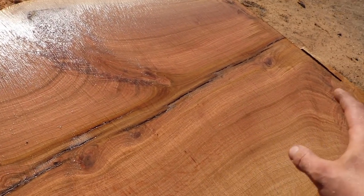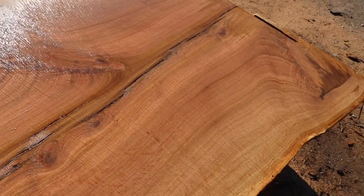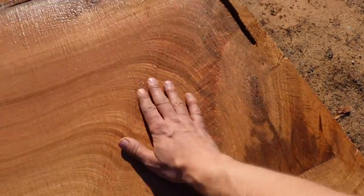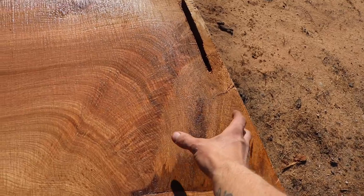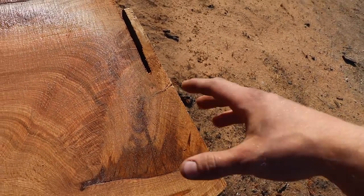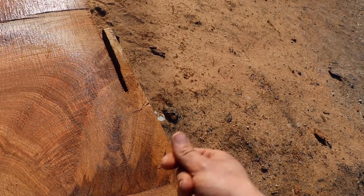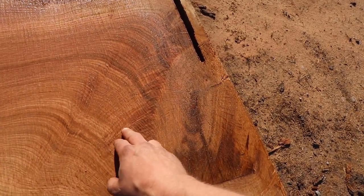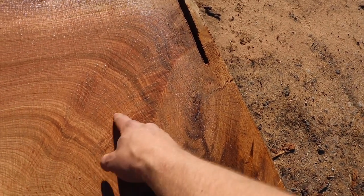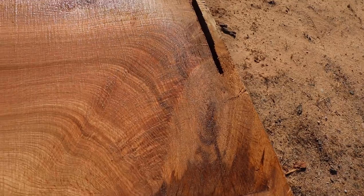And sometimes, if the pith is really bad, the center slab, as soon as you cut it and try to move it, just breaks in half. But over here, we can see some really nice looking figured grain. This is probably because we have this big branch that grew out like this. We can see the end grain here. So this was a big branch hanging down from the tree, and it had all this weight, you know, with wind and snow and the leaves. The leaves actually get pretty heavy. They're full of water. And so the wood reacts by producing this convoluted grain, like some type of reaction to stress. And you have all these streaks going through the yearly growth rings here. So that's looking really amazing.